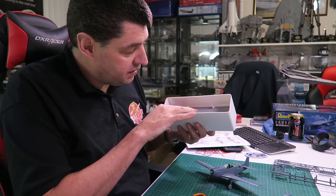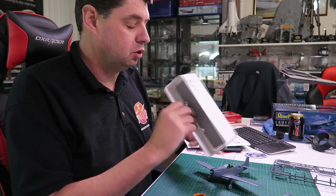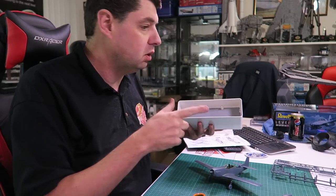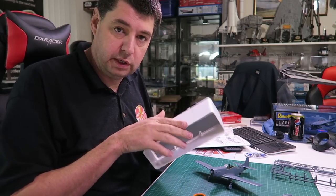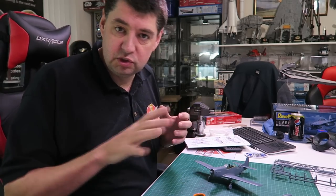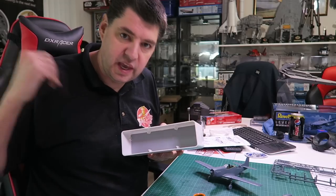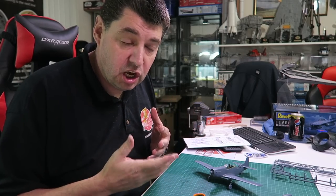Another thing showed up today — not a kit for once. We've got a backflow inhibitor, so as long as I put it in the right way around we'll be absolutely fine. We won't have the trouble with both spray booths running at the same time. I've also got an adapter ring so we can have two of these going into one big 120mm outflow which will take all the hose out. This afternoon I'm going to get into the spray booth, pull it apart, and install this — it'll make a world of difference and stop the air recirculating and coming back down.